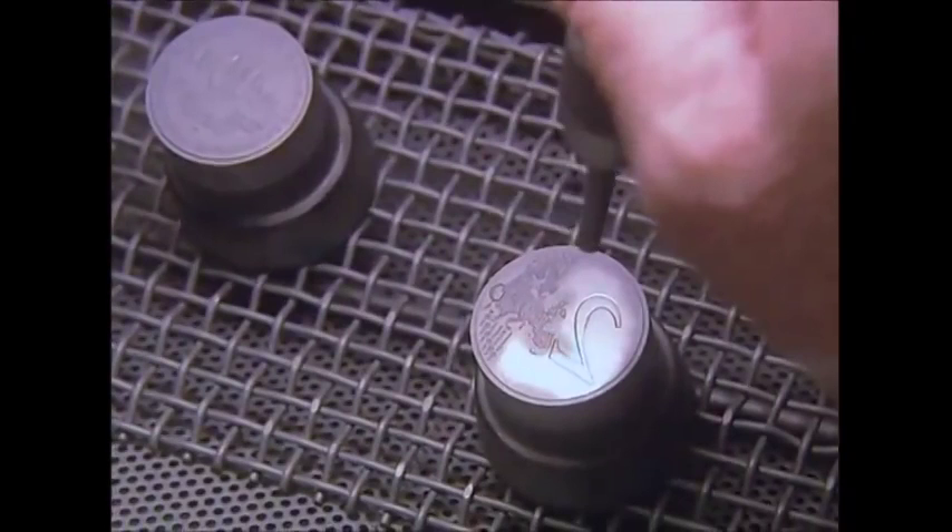The stamp is fitted into the machine. At this point we don't have any complete coins to stamp, but everything's about to come together. The ring is put into place and the filling dropped into the hole. The two are then placed under the stamp, which hammers them together — this both impresses the value onto the coin and compresses the two pieces together. What emerges from the pipe is a brand new 2 Euro coin ready to be spent. By crushing together some ordinary copper and nickel, we end up with the elegant sophistication of the high-tech 2 Euro coin.